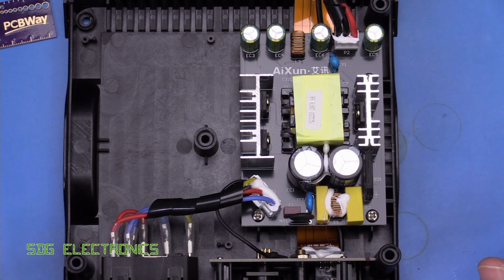Now, the FFC is siliconed in, so I can't remove the back panel PCB, but I think all it's got is the USB connection and also the connection off to the soldering iron. There's no components on the back here, really. I think just something like an ESD diode, I saw down here. So it looks like they're actually running the USB connections along this flat flex as well, on the underside just here, and then off to the PCB at the front.